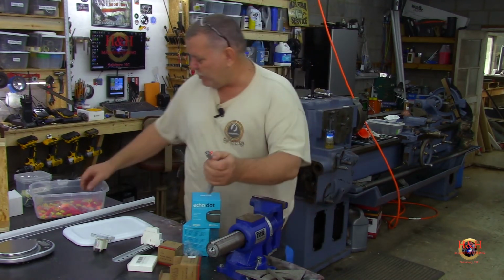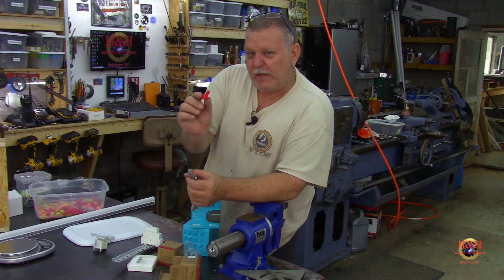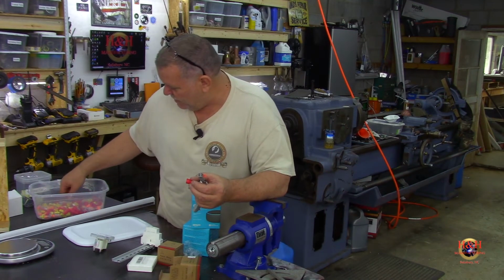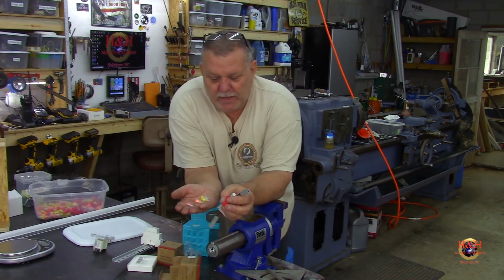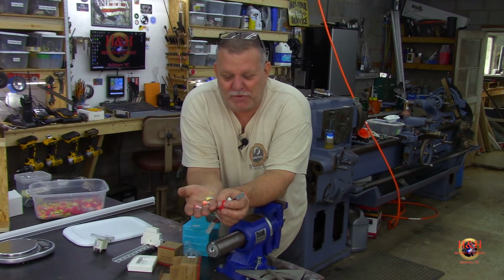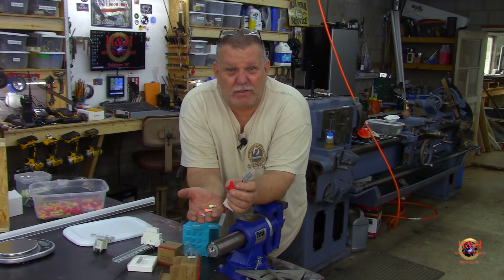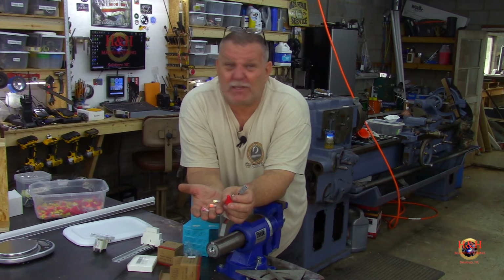But then while doing that research, here's a standard wire nut. While doing that research, I found these Ideal, I can't remember the name exactly what you call them, but they're push-in wire nuts. Well, I got all those in the conduit completely done before I realized these were available. So if you put on wire nuts on number 12 wire, your fingers will wear out. And I ran, I think, eight of them in that conduit, so 8 sockets.